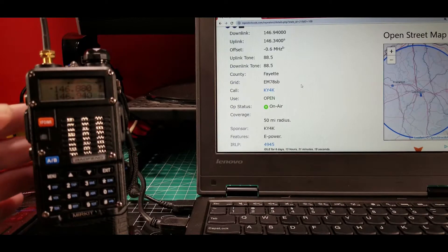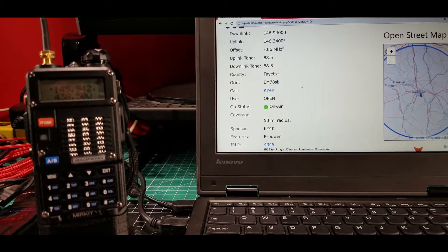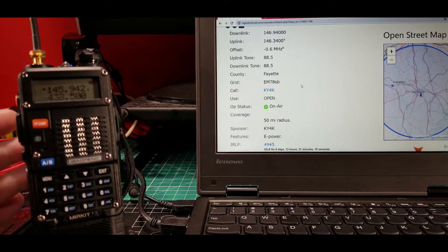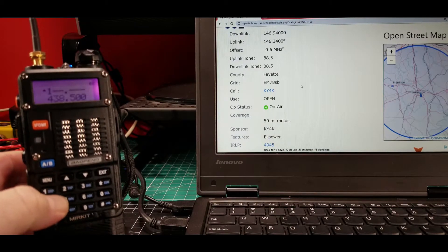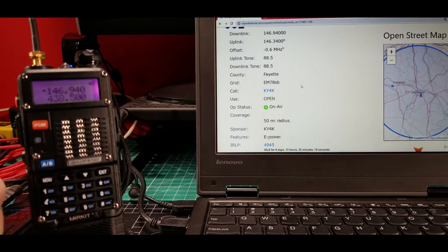You can do this manually as well — it's not like there's dozens and dozens of settings. You can make yourself a little cheat sheet and just keep it with the radio. So let's switch over. We have this orange button, VFO/memory. Now it says frequency mode. This repeater is at 146.940. So we're in frequency mode, and we can use the keypad and just start typing it in: 146.940. Now we've got the frequency put in there.